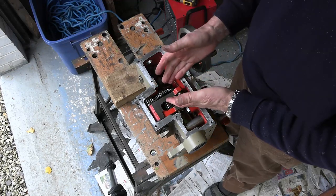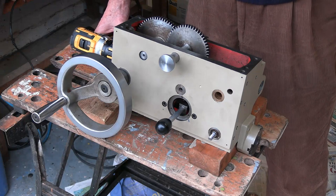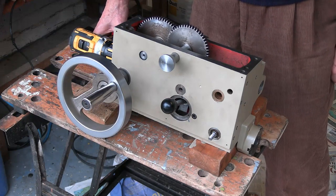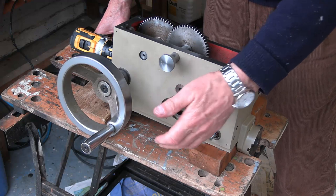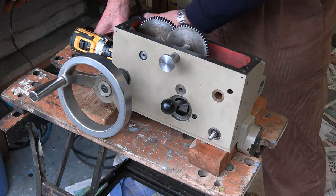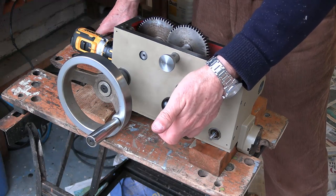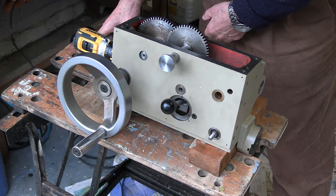So now I see the nature of the mechanism. Let me turn the apron the right way up now. So now this is the right way up and if I apply a drive nothing happens until I lift this lever. What's holding that lever up at the moment is that as I lift the lever up there's a hook down there which engages on a ledge. If I reverse the feed direction, you see it fell down without my doing anything. This is because the hook is not engaging very effectively on that ledge. So that's a problem that I've got to address.